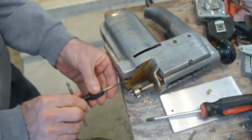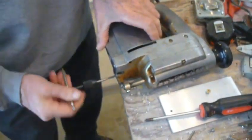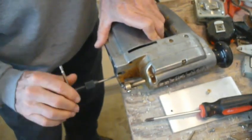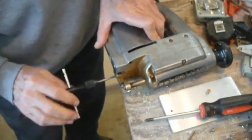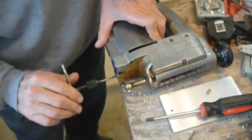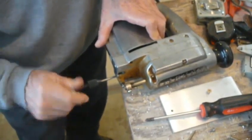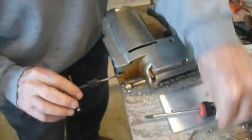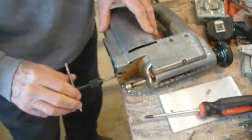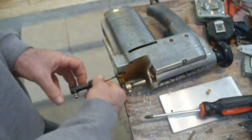Now it looks like it's not giving me a lot of trouble. Aluminum is a fairly easy metal to work with, but it's also a pretty easy metal to screw up. Now these already had a tap in them, but a wrong size tap from a different type of screw. These were the self-tapping screws. It surprised me that they actually put those type of screws into this metal here. The engineer should have known better.